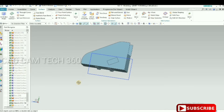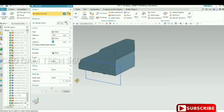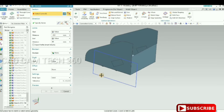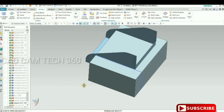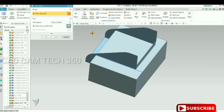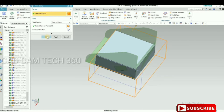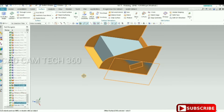Now we are going to use this sheet to make a punch. We select the curve which we already used to make the die. Using that same curve, we go to Extrude and make the solid body. Click OK. Then use Trim Body — click on the sheet, middle button, then click on the solid body. We have got a punch.